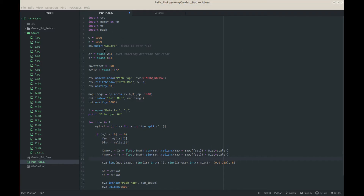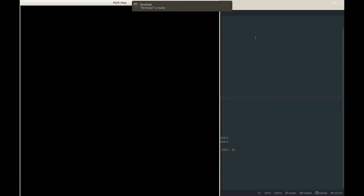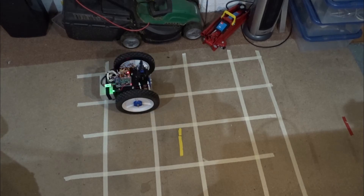For now I want to take the data log and see if I can reconstruct the robot's path. I took some Python code that I've previously used for plotting robot paths and modified it slightly to suit the new data format. I'm ignoring the data captured when the robot is scanning and fed in the data log, and this is the path that resulted — a nice square representation of the path followed by the robot. I'm only capturing data at key points: the end of straight runs and during turns. You'll see the square doesn't quite join up at the end, and going back through the video footage confirms the robot doesn't finish in its starting position — and the map is quite representative of this.